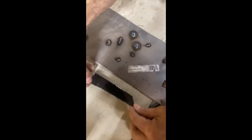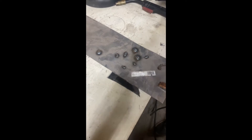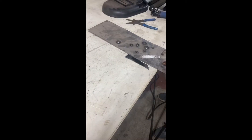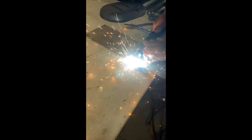Good news — I have graduated to a butt weld. Named such because you have two pieces of metal butting up against another piece to make a level surface. To illustrate mistakes to avoid when doing a butt weld, we showed what happens when we make a gap in the metal, when we don't prep the surface, and when we don't turn on the gas. This made a pretty raggedy weld. You can see holes in it — it's not very strong and breaks apart very easily.